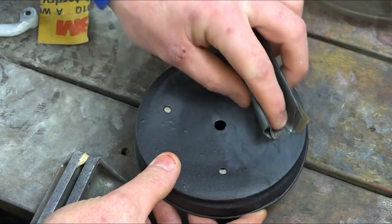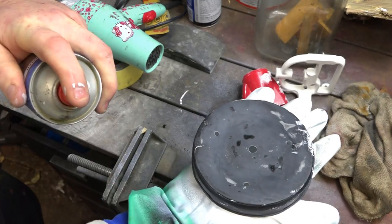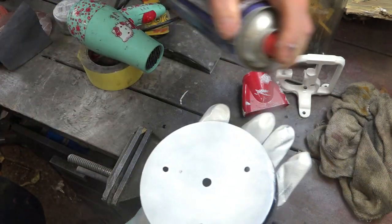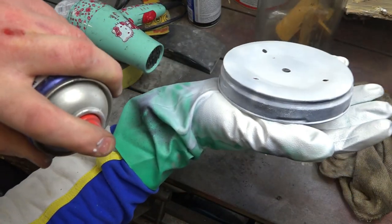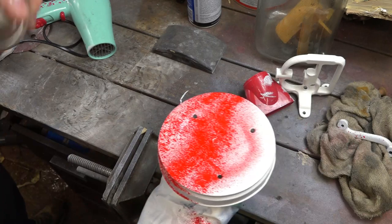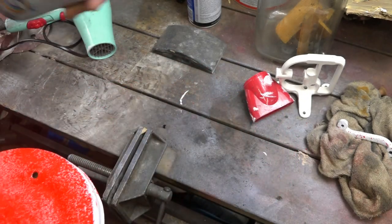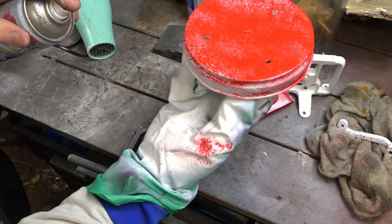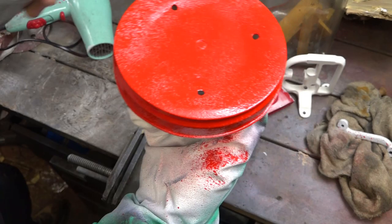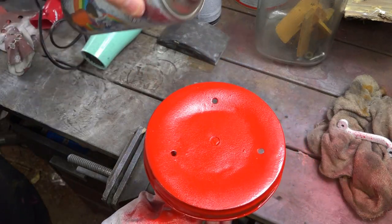I haven't been able to keep the exact shape of the lid but I've got it as best as I can. I always like to go with a light base coat — usually white or a light grey — if I'm putting a light-coloured paint on top, as it saves a lot of coats of your top coat. This is an enamel paint and because of the cold conditions it's coming out of the spray can like absolute rubbish, so it's just a case of putting on some really fine coats and a lot of them. What I'll do is warm the can up in a bucket of hot water — that gives me a better fan pattern. We're only one or two degrees above zero in Yorkshire at this time of year, so it's not helping. As you can see, putting the can of paint in hot water has made the spray a lot better.